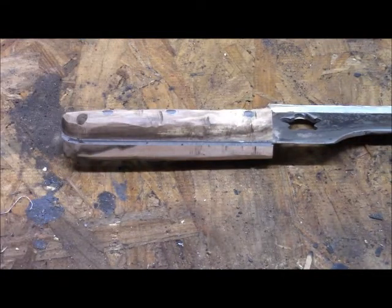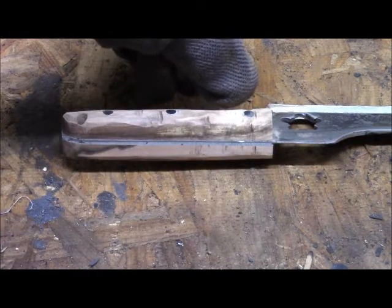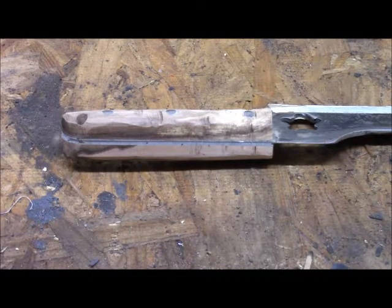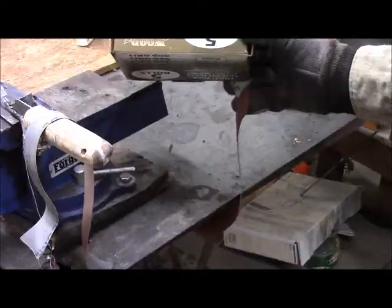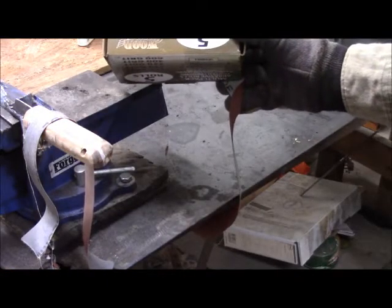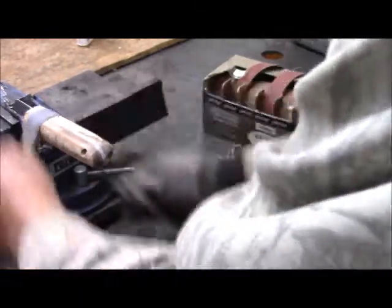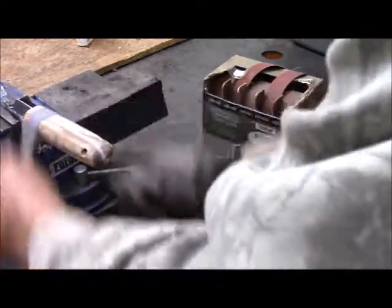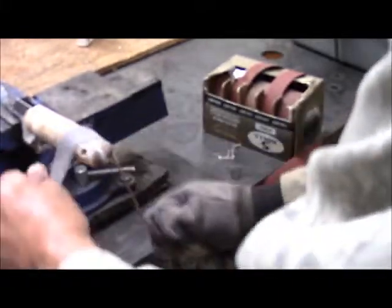You remember on the original piece of wood, perhaps, in a previous video, that was a knot hole. Well, I put this pin in that knot hole, but here is the other end of it here. And that is dead soft. So we'll need to put probably a filling compound or super glue in it to seal it. But we are working on it, and it's certainly looking a little better than it was, but it's far from finished. I'm using this variable grit strip sandpaper to help round the grips themselves and get some of these divots out, as well as take off any sharp corners so it feels better in the hand. And because of the great difference in the strength of the materials, this seems to be the best way to go right now.